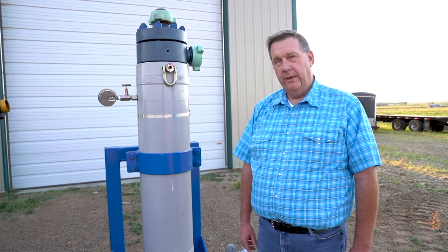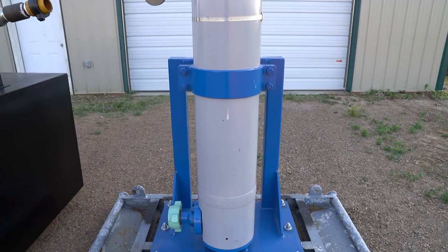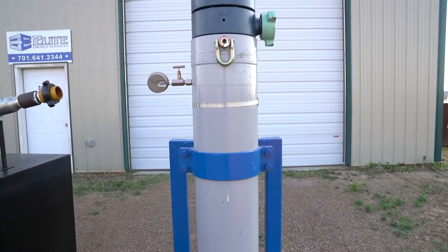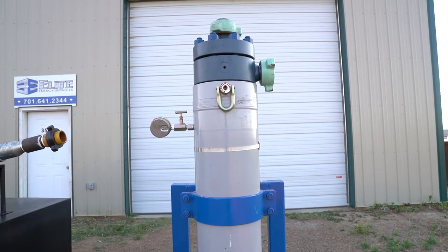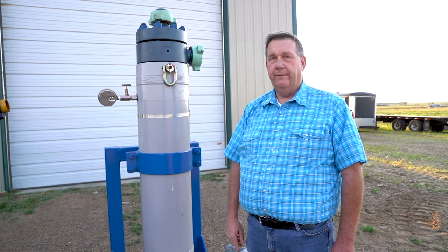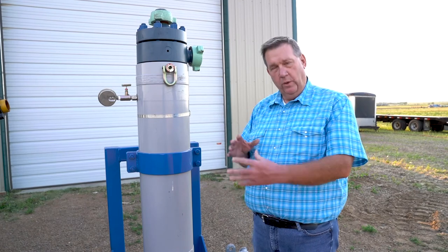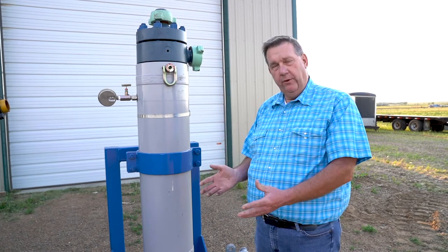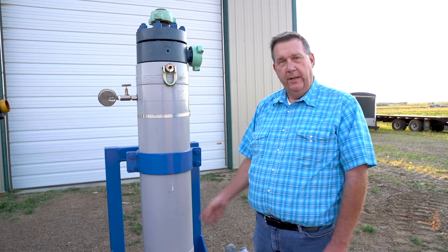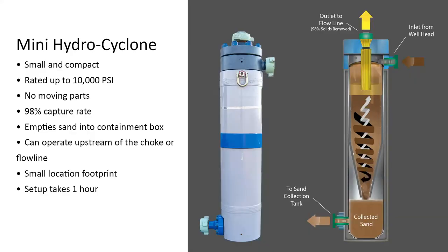As I studied more, I found that mother nature and physics has already given us the solution to this problem. I'd like to introduce you to the high velocity hydrocyclone. These units are designed so that as fluid comes into the top, the fluid begins to spin at a very high velocity, and as that fluid spins, any sand and solids work to the outside. As it goes down further and further, the fluid begins to spin even faster. It works off the same principle as when you go to the fair and get on a tilt-a-whirl — the g-forces as you spin push you against the wall harder and harder. This is exactly the same principle.